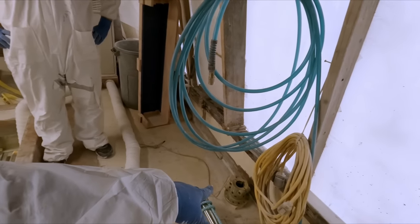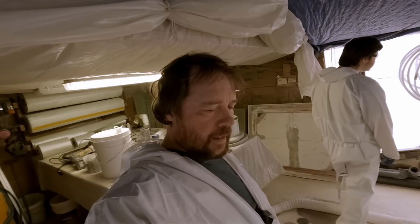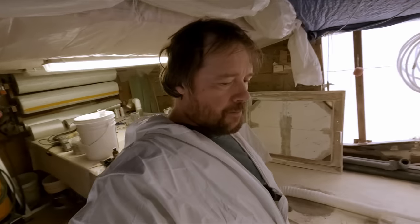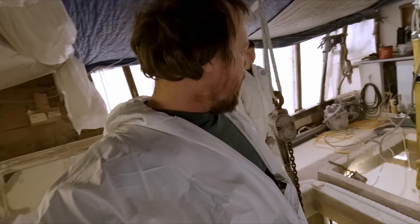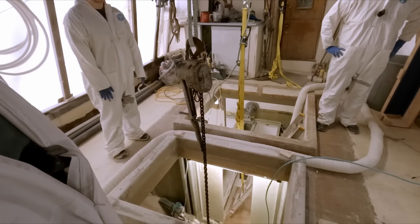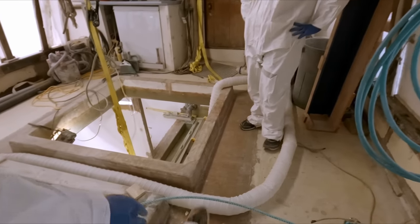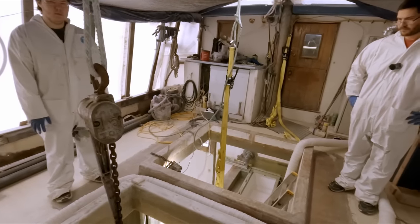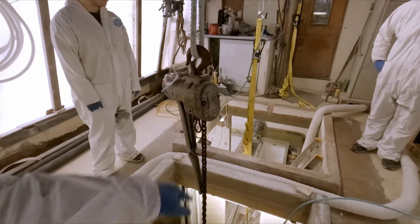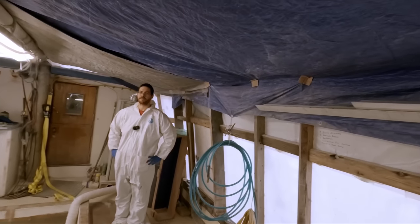We have the coupling off because it needs to come off to go through the bulkhead into the engine room. We had it off prior to this, and it's just a hassle to put it on and pull it back off again. So that'll be fine for that. We're just gonna get hooked up to it on this chain hoist and start lowering it down. Once we reach the limit of this chain hoist, we'll use this forward hook, hook into this other line right here or tie that off on one of those loops, and let that take the load. We'll rehitch our chain hoist more forward, or I guess aft, and continue the process till we get it down there.